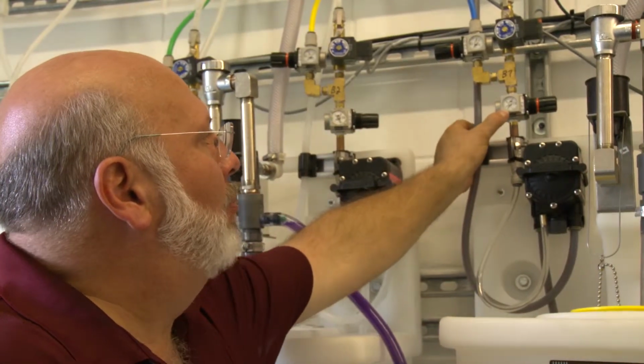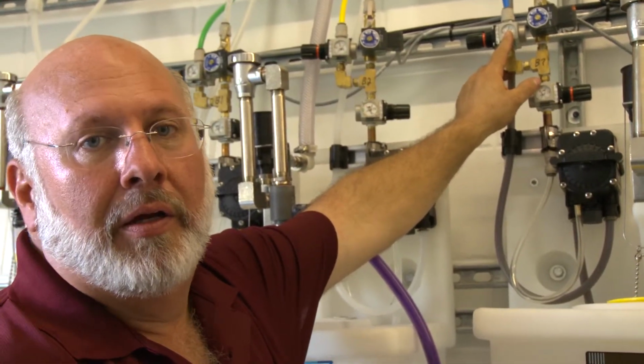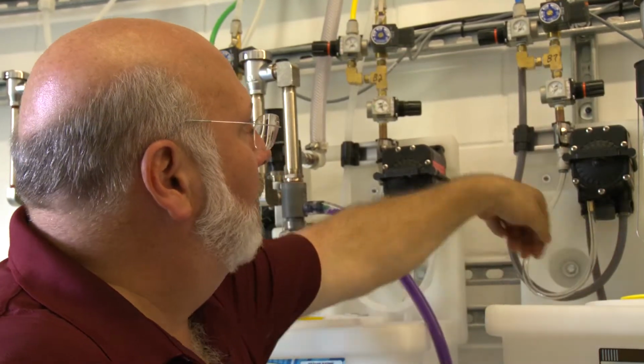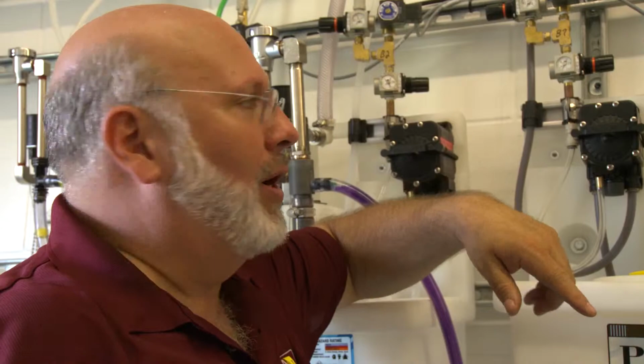So right now, we've got this pump running about 35 PSI. We've got our air pressure at about 10 to 12, 15 PSI, okay? You hear the pump running. It's pulling the product mixed out of the tank and delivering out through this line out to the CTAs. We also like to split it in the tunnel, in the middle, so we evenly distribute it to the product.